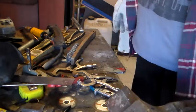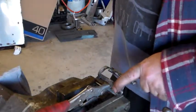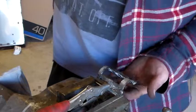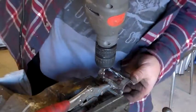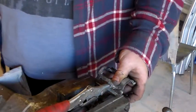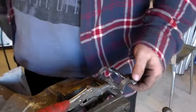I'm still not entirely sure this is going to work yet, so we'll see how we go. What I've done now is drilled two 4.2mm holes in the tabs on this side and the tab on the other side. I've got the other tab mounted in the vise — the one that's going to be welded to the injector module. I'm going to drill through into that tab again with the 4.2mm drill bit, then drill those holes out slightly larger, tap the holes on this side with the M5 tap, and run a couple of bolts through.